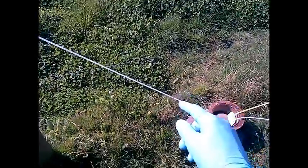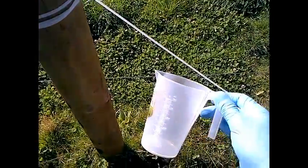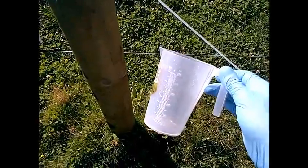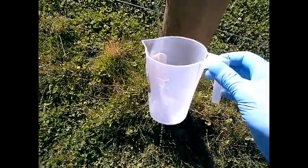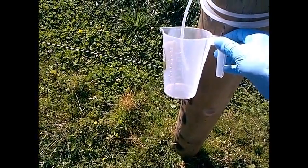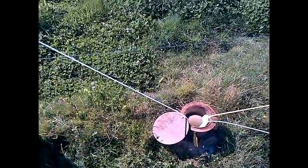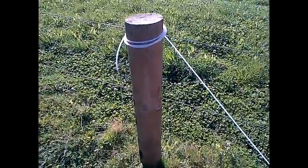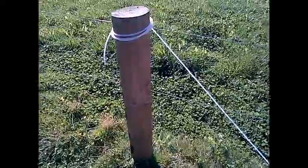Before the product comes to the top, you're just pumping air through and it's very difficult to know what the pump is doing. What you can do is use a jar of preferably distilled water or clean drinking water, and watch the bubbles come out of the pipe into the clear water. That shows you the pump is indeed pumping, even though the water hasn't quite reached the surface yet, and it lets you dial the pump in prior to the product actually coming up the well pipe.